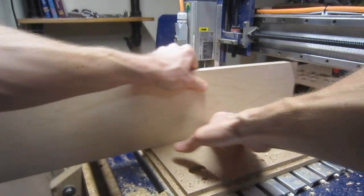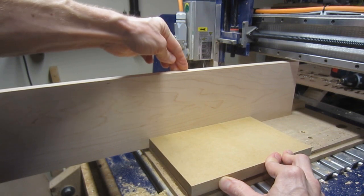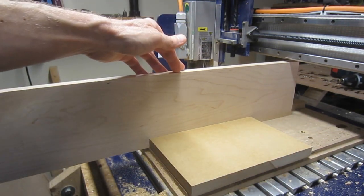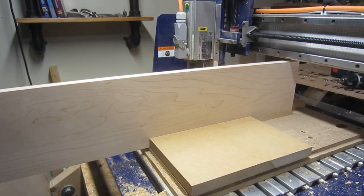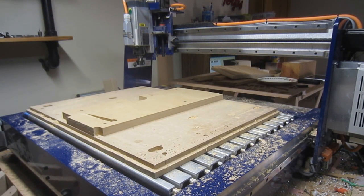For instance, if the boards had been wider, they would have been inherently less stable standing on edge and may have needed different fixturing. Also, after a certain board width, limits of the z-axis would become a problem. In addition, boards that exceed the dimensions of the CNC's workspace would also be harder to work with using this approach. So when a similar project using longer and wider boards came up, I knew I needed to try something different.